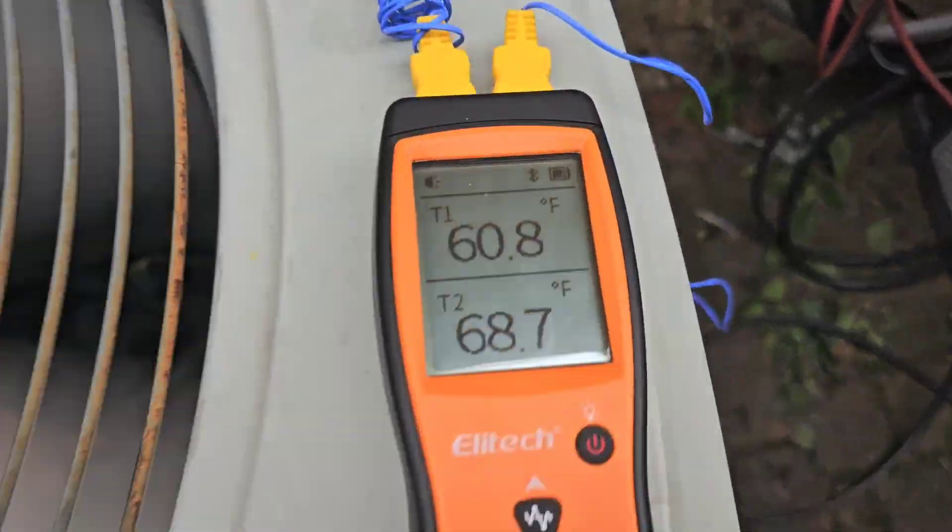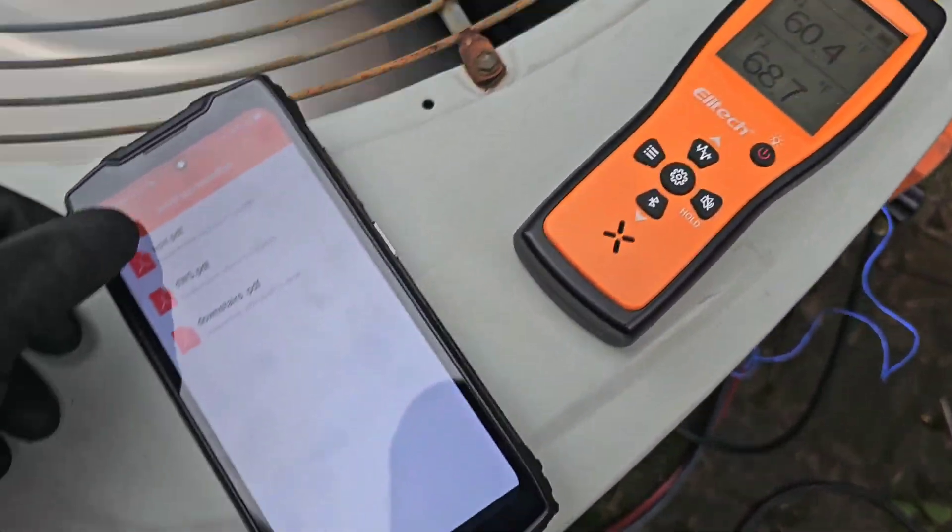Like I said, it's cold up in there. But you got good tools like this, you can pretty much check your pressure at any time. I'd like the temperature to be at about 65 degrees or above, but you'll at least get a feel. Now if I look at my gauges and I'm seeing like 20 or 30 PSI on my suction or some crazy high head pressure, you can kind of diagnose it. That's probably going to be a problem — 20, 30 PSI on the suction is probably going to be a leak somewhere. But since we're borderline — high 90s or something like that — and you still remove the heat, you know, it's cold out here.